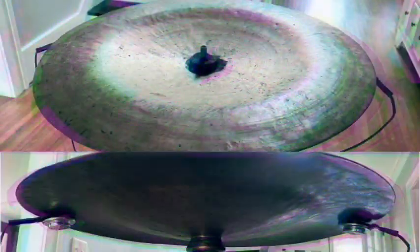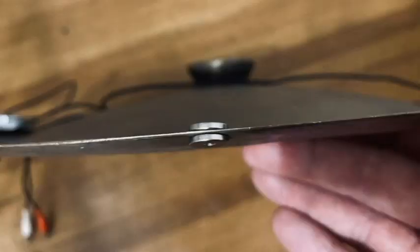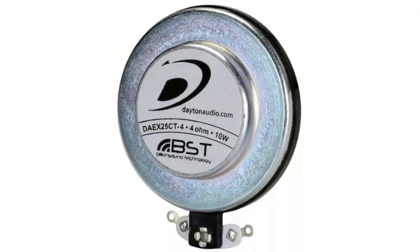I was originally going to position the speaker perpendicular to the floor like a typical guitar amp, but I found that it choked the sound a bit, so facing it up seemed to make the most sense, and I could place objects on the speaker to change the sound. This leads to a whole other chapter of experimentation. I also found that attaching magnets to both sides can be used to modify the overtones. The options are endless. This is the transducer exciter I used.